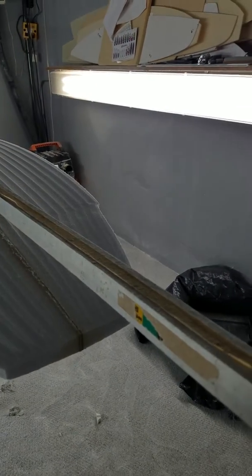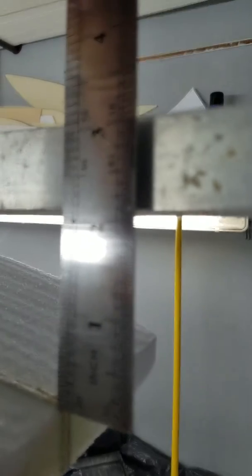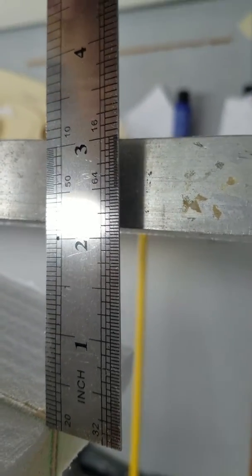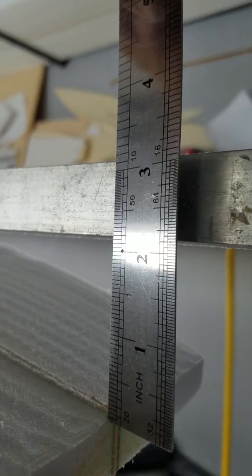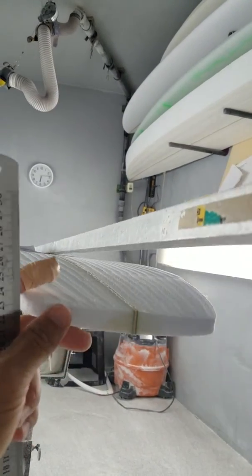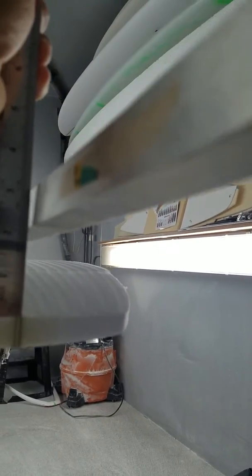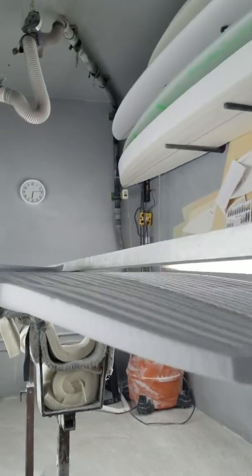Everybody was wondering why I don't level the blank — why you've got to put a bubble on the level and all that stuff. You don't. As long as the blank itself is relatively level and balancing under its own weight, you set the rocker bar at the exact center. It doesn't really matter if you move the board itself up or down — the rocker bar stays at 2.2. In almost every case that will stay true. You don't have to level that rocker bar. This is hard for people to grasp, but you try it and you see for yourself: 2.2, no matter what.